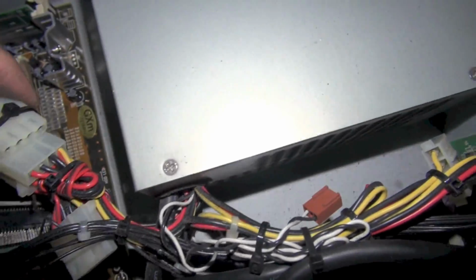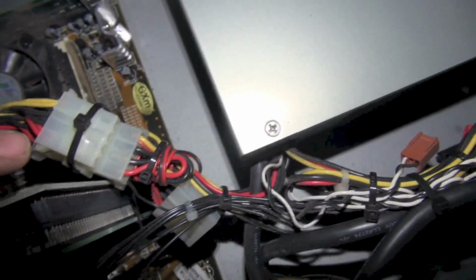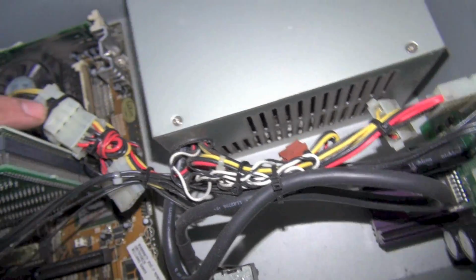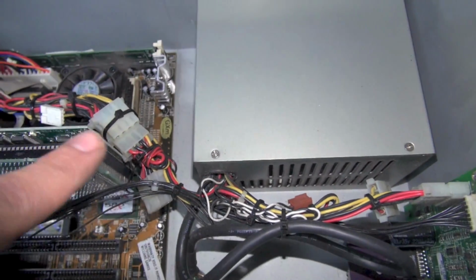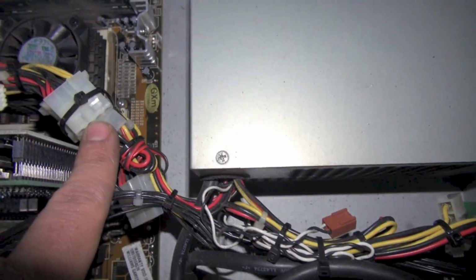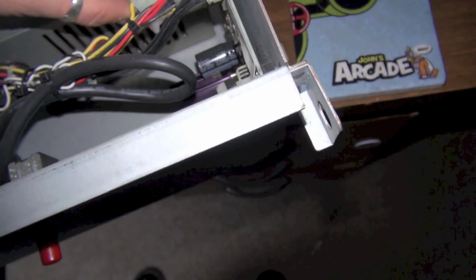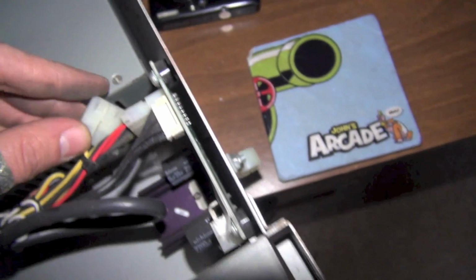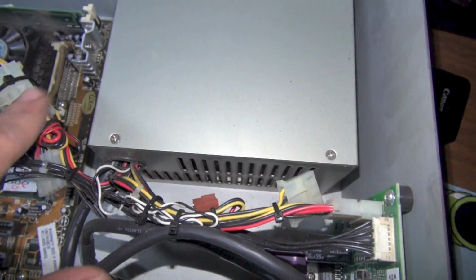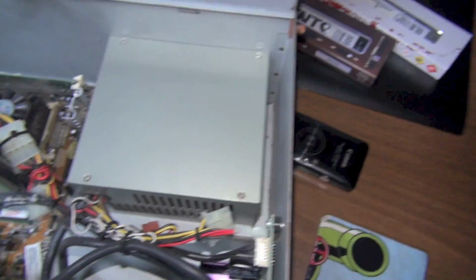This red, here's an open Molex right here. So this red here should be 5 volts, and here's our black, which should be ground. So I'm going to tap into that, and I'm going to use my multimeter after I power this up just to make sure that it is indeed 5 volts and not some other mysterious voltage, but I'm pretty certain the red is 5 volts. And here's another one over here we could tap into. So I've got to run a ground wire and a positive 5 volt wire from in here out the box into the video amplifier when we mount it.